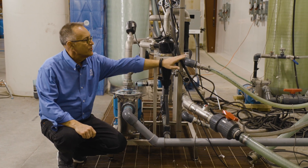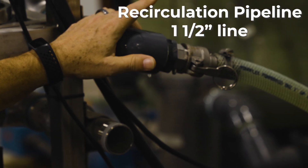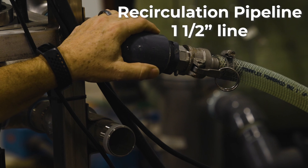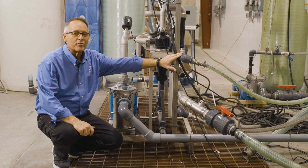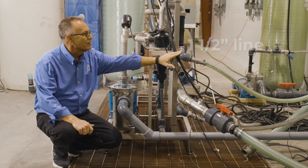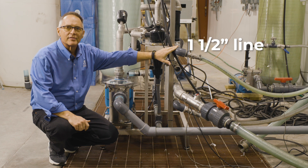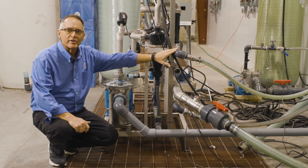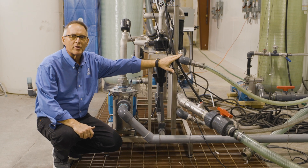From our design, the first thing on the unit is going to be a recirculation pipeline. The recirculation pipeline goes back to the tank, circulating 35 gallons a minute of water along with oxygen and ozone to properly maintain the oxygen level in the tank. The inch-and-a-half line always wants to stay an inch-and-a-half line all the way to the tank — no reductions. Reductions cause back pressure, and back pressure causes problems in the flow of water back to the tank.